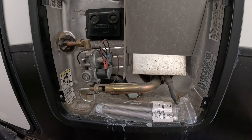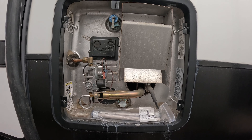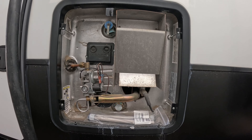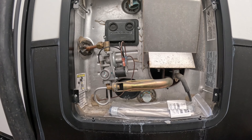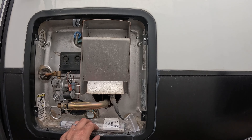I'm going to open it up and set the cover aside. Now you want to make sure that your hot water heater is off for this, because you don't want the electric element to possibly burn out. So we're going to flip that off. The other option is gas, which is currently off as well.